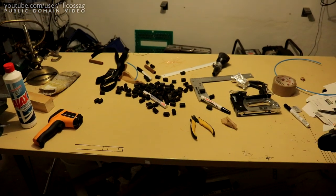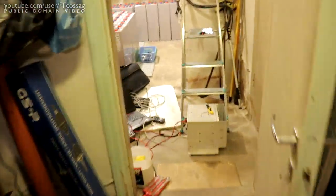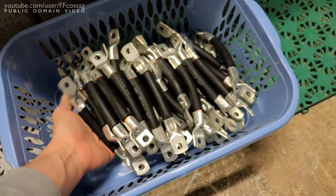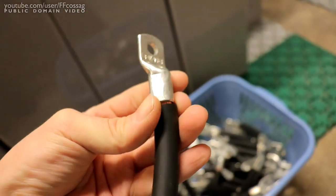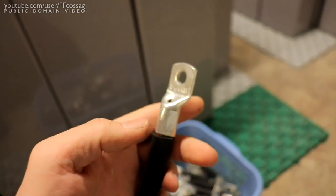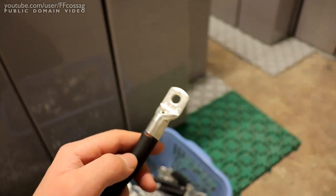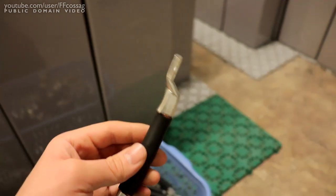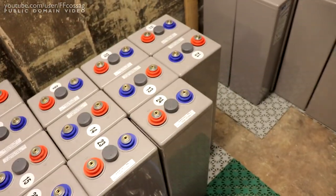Jumper production is over — let's head into the battery room. Testing at six volts, these guys are doing well. Here are all of our handmade battery jumpers. The cable shoes are for 70 mm² cable, the cable itself is 50 mm², and I had the crimp tool set to 35 to crimp the cable a bit tighter than it otherwise would. It seems to have done a decent job — it's very tightly in there and I'm happy with it.